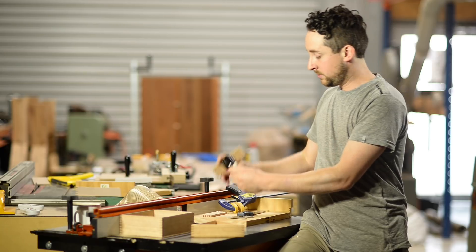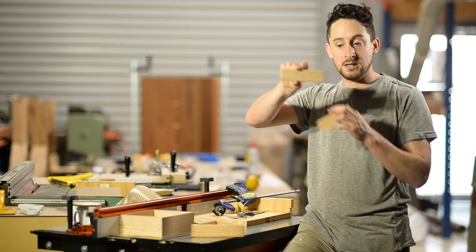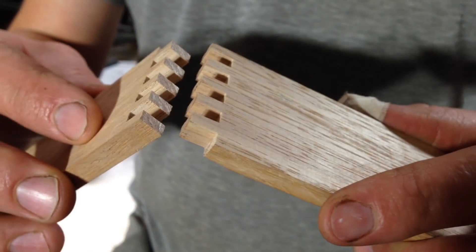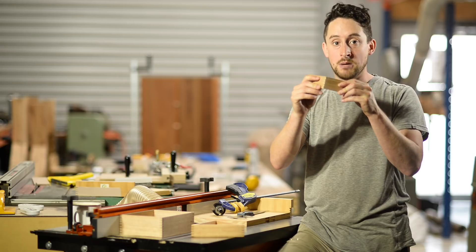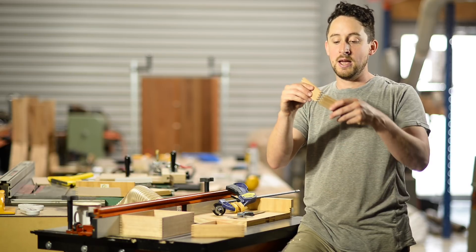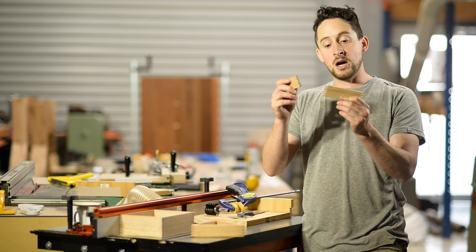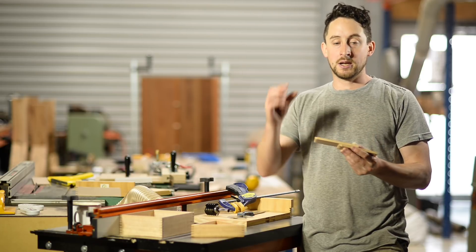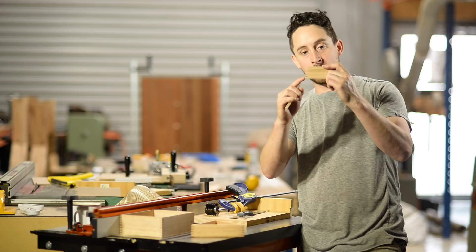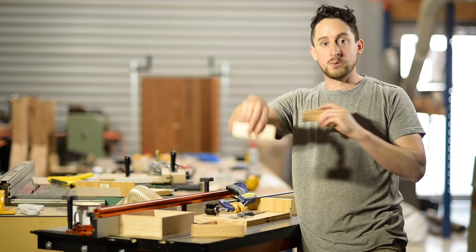The reason you want that last space on the top is that when you have your two pieces and join them together, you do one piece with the top edge facing up and the other with the top edge facing down. That allows you to join them together without altering the height of the bit — just by flipping them over and getting them to match up perfectly. So that's no changing of the bit height, only one pass for each cut. Now if the joint you're trying to do is shorter than 40 millimetres, make it a multiple of four — and an even multiple of four. You need it to be an even multiple so that you have a male tooth on the bottom and a female notch at the top on each piece, because it allows you to pass one through the correct way up and one through upside down.